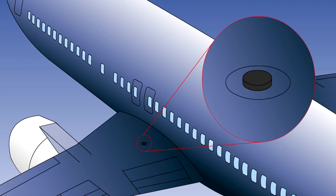Mechanical indicators may also be provided to show that the landing gear is down and locked if the electrical indicating system fails. For the main gear, these are often just buttons which pop up on the top of the wing when the gear is locked down. They can usually be viewed from the fuselage windows. The nose gear will often have some sort of periscopic viewer in the cockpit floor through which the down lock can be seen. Some aircraft don't have mechanical indicators; instead, they have duplicated electrical down lock sensors.